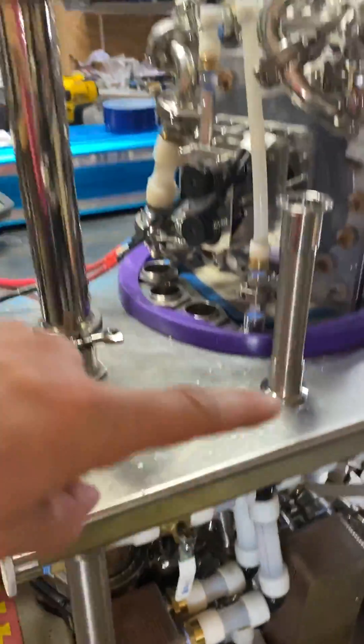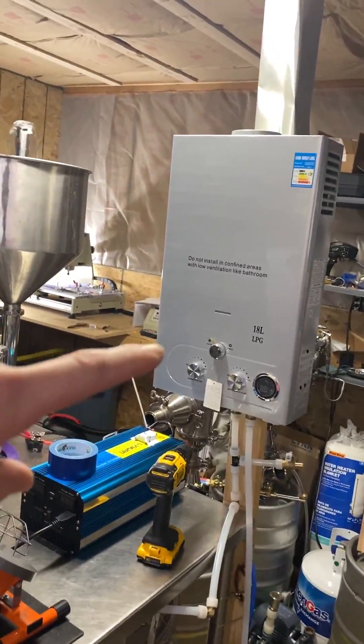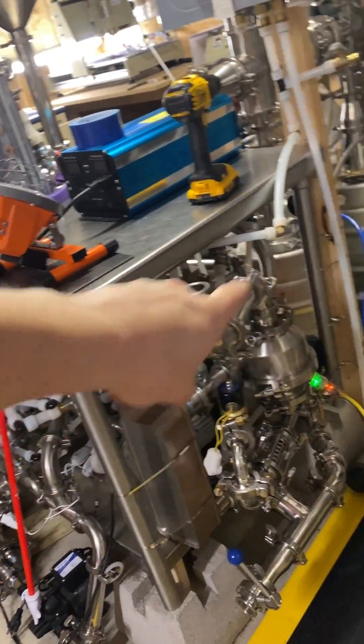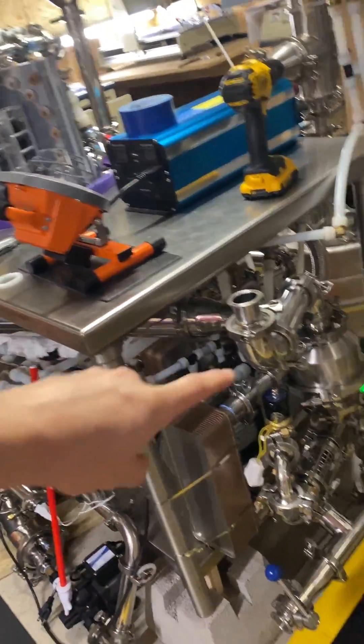The pump down over there circulates all the water from the condensers, all through the condensers, and back up into here — so that's the cooling one. For simulating the biomass boiler, we're just doing a propane water heater, and that'll go to heat up the boiler and heat exchangers from the superheater.